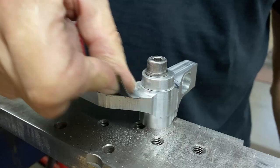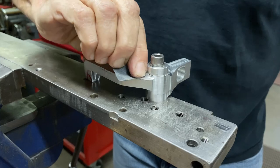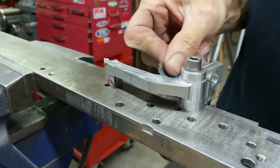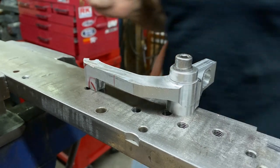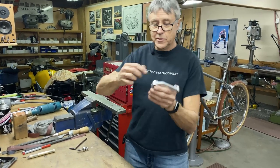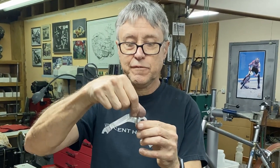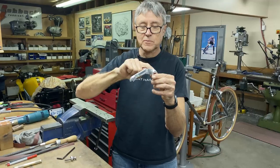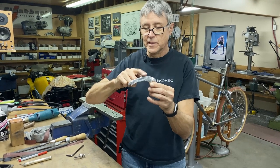Because what I'm doing today, I'm just going for the shape. I don't have the time to make it all smooth and shiny in the space of this video, so we're just doing the shape. I'll put the vise back in the mill and we're going to mill this down. See that lump there? That lump has to go flush with that radius there. Once we do that, we can do those hollowed-out bits on the top to make it look nice.